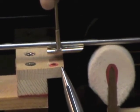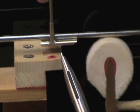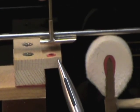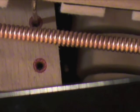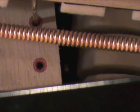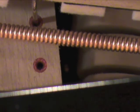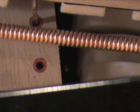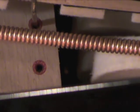If we don't have a minimum of at least 5/8 of an inch from the contact point to the front edge of the damper guide wire hole, the muffler rail will not fit. Okay, let's see what this looks like in the piano. I have removed damper number 1 only for the purpose of videotaping. You do not have to remove any dampers to do this measurement.